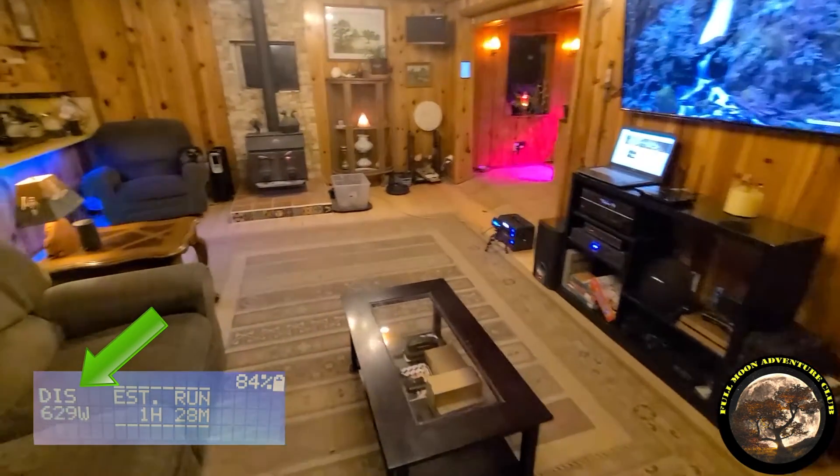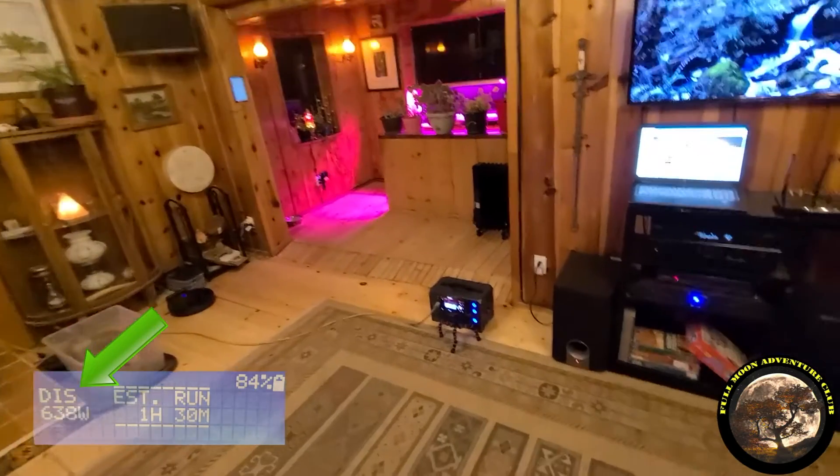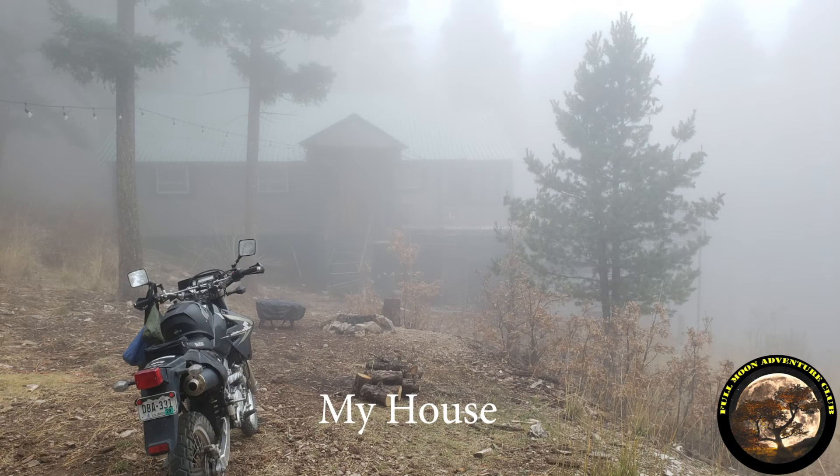With no dryer and no water heater running, my house uses way under 2,000 watts during normal operation. Everything's LED. I go around the house and turn off everything when the power goes off — all switches, unplug anything not in use. Then I turn off the dryer and hot water heater and usually only pull around 700 to 1,000 watts. Your house, if you go this route, is going to need way bigger wiring and way bigger generators. I have a 100 amp service — you probably have 200 amp service — so this will be a completely different setup for most people.